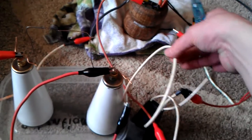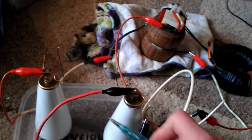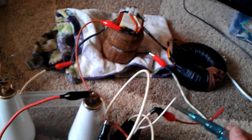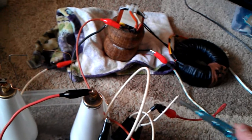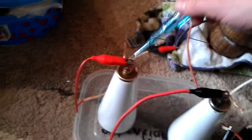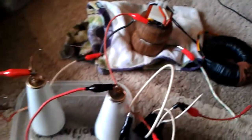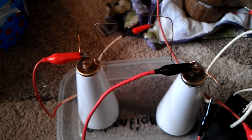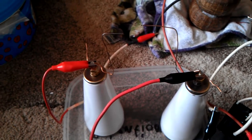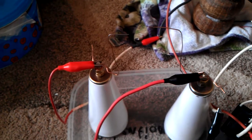And this quite thick cable, which is the main output, this goes to one of the electrode output standoffs just there. And this one here goes to another unit — it's got two unit outputs. And this standoff just here goes to the other output of the x-ray transformer. So the normal output for this is normally around about half an inch at 40 volts output.